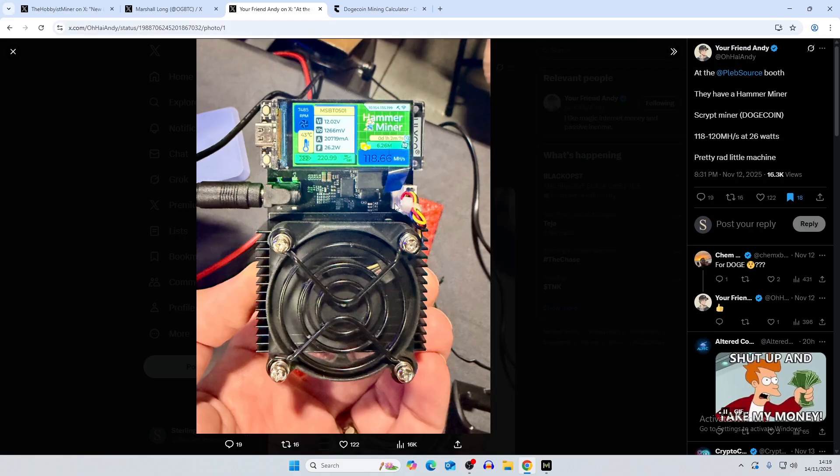It has a 40-millimeter fan connected up here — normally on the BitAxe it's connected down lower. The heatsink seems to be slightly bigger than 40 millimeters, a rectangular heatsink just slightly off square. Overall it's kind of the same design as a BitAxe with a couple of modifications. On the display you have fan RPM, chip temperature, efficiency, watts, amps, and volts, similar to the Nerd QAX.